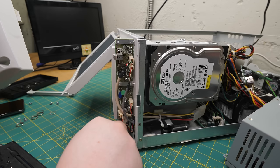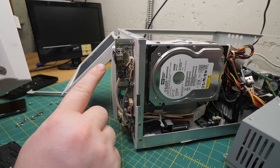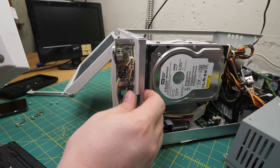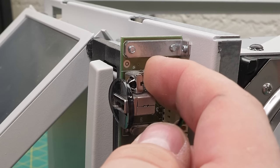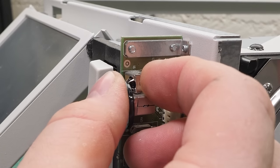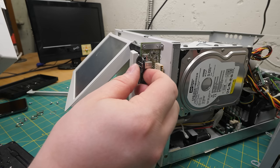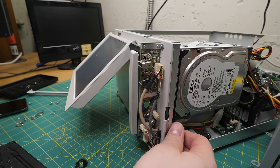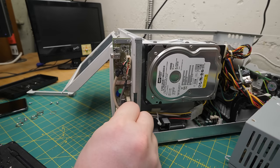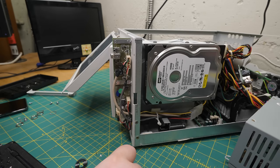The little plastic bezel around the USB port is translucent - I thought that was just a style thing from the 2000s. But in reality there is an infrared sensor behind there. This is actually an IR window. So this thing would have had a remote control for triggering a record. That two-pin coming off of there loops over to the capture card, and they're just using it as a GPIO to tell the software when to start recording - at least that's what I'm guessing.